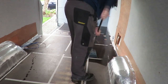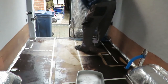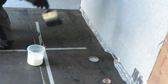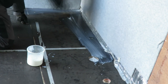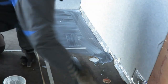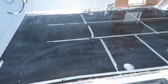I'm just giving the floor a wash over here with some water and a little bit of washing-up liquid. The tip you can see on the floor I couldn't get up, so I didn't bother — I thought if it's not going to come up when I'm trying, it's not going to come up when it's underneath the lino. Now I'm sealing the floor as well with the same 50/50 PVA and water mix, going all over the floor with this. It'll just seal it and help the glue stick — stopping the glue absorbing into the wood and making a better job of sticking it down.